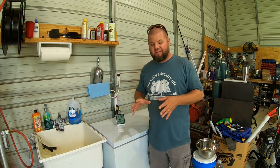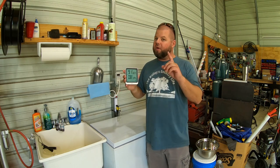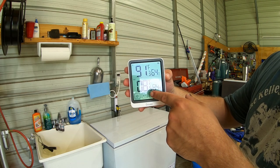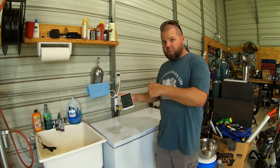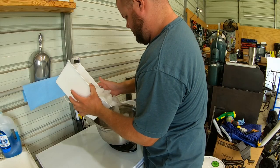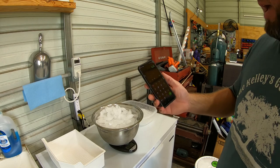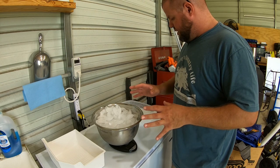It's been 24 hours on the fan-in-tube test pulling cold air off the bottom. This is actually the second day I ran this test — the first day gave inconsistent results because the freezer was open for a while setting everything up and got kind of hot inside. These tests literally take days sometimes to do one single test. We're still not getting the results I was hoping for, but they are better. It's been extremely hot outside — up to 101 degrees in the shop. We've been staying 5 to 9 degrees up top, versus 12 to 15 degrees before we started pulling cold air off the bottom. So it has made a difference. Result: 8.95 pounds.